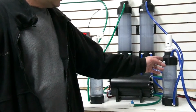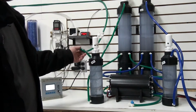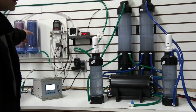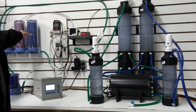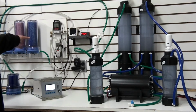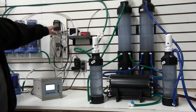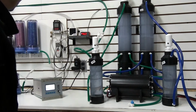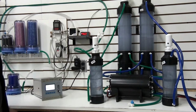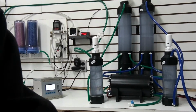From the bubbler on the oxygen side, the oxygen is vented to the air. On this side is where we capture the hydrogen, and right now I've got it going through a system of dryers and another bubbler over here on this side that you can't see, and then goes through a flow meter where we can see the flow of hydrogen. Then from the flow meter it comes down and it goes into this purity meter. I'll give you a close-up of the components.